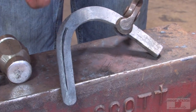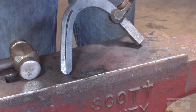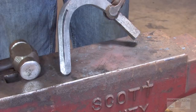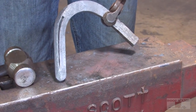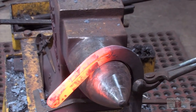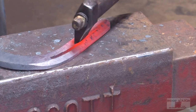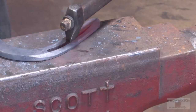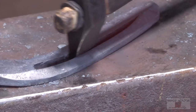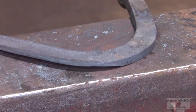I'm gonna just pick it up a little bit — when I say that, I'm just gonna run the edge up a little bit and fuller it. I want to keep it in the straight because you can keep your lines cleaner in the straight. Once you put it on the bend, you have to slow down so much because every overlapping hammer blow makes it hard to get a nice flow in a section. So the longer I can keep it in the straight, the better off I am. Just trying to get a nice line in there, because it'll all tighten up when you bend it. When you make that branch bend, it'll tighten up and then you'll have a nice consistent line.